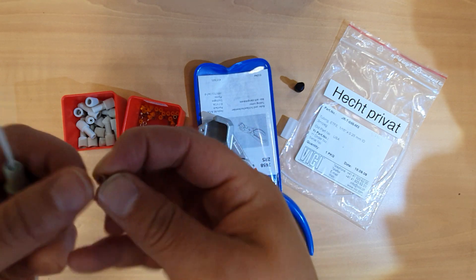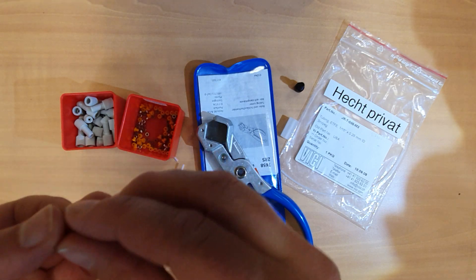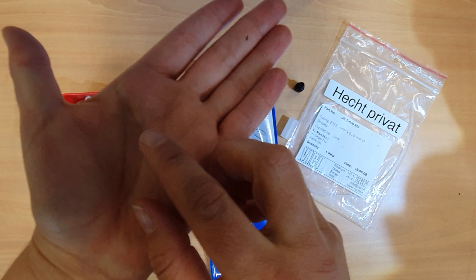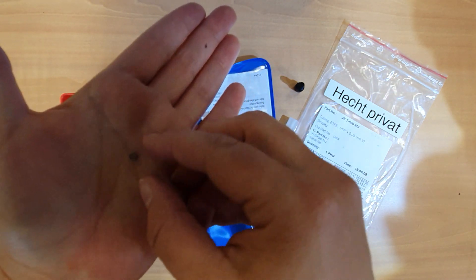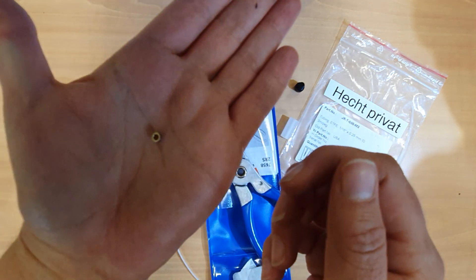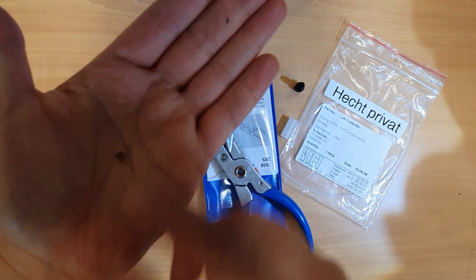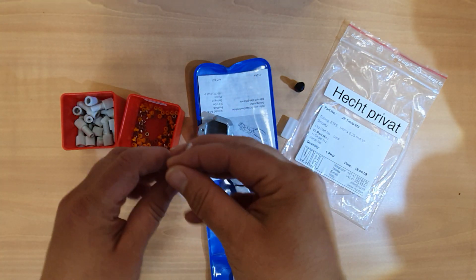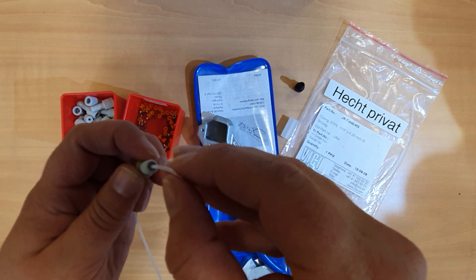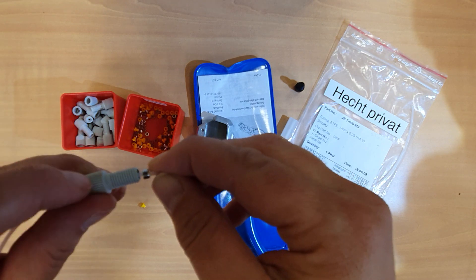First is the metal ring, and you need to pay some attention to its orientation. The metal ring has one side that's very flat and another side that's wider. The wide side is going to push against the fitting and should fit right into there. So the metal ring goes on with the wide flat part pushing against the nut.